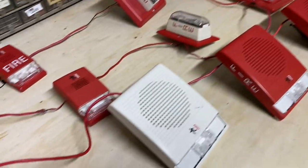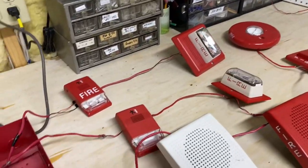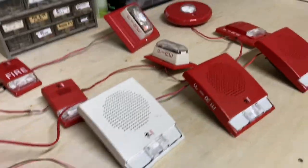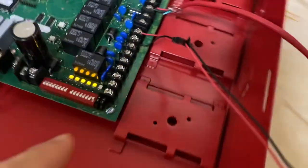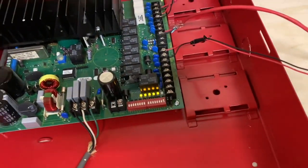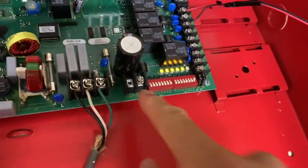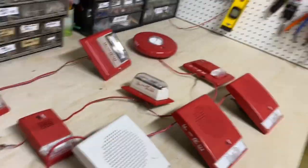A few other things: you're technically supposed to have a resistor on the ends of these NACs, just like any other NACs, so that way this is supervised. If you don't have a resistor — and I don't have one — there's going to be a trouble. If there's a trouble, that will cause the main panel to go into trouble because you're supposed to wire the relay that way. There is a trouble relay here. You would wire it so that when this trouble relay clicks, the fire panel goes into trouble, so you know something's wrong with the booster panel. You would also have a battery here, because if the main fire panel has a battery, this should also have a battery, so that in the event of a power failure, this still provides power for the notification appliances.